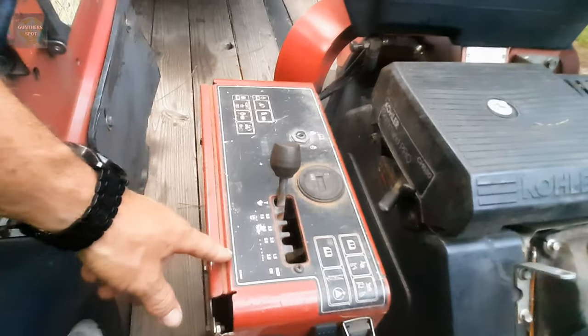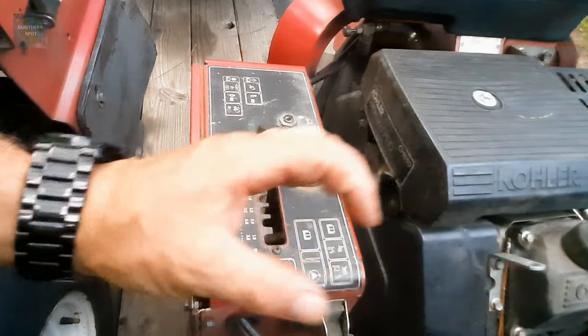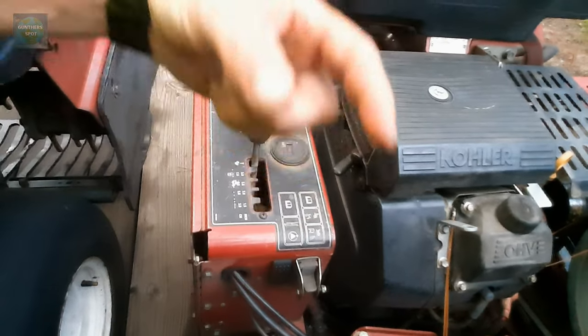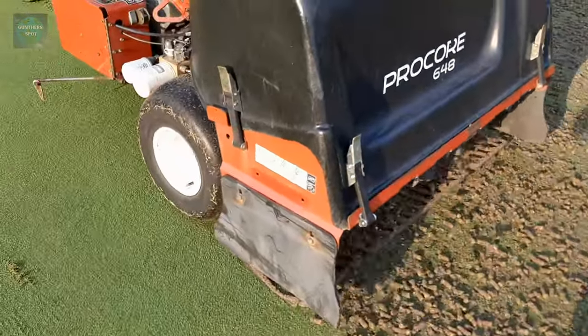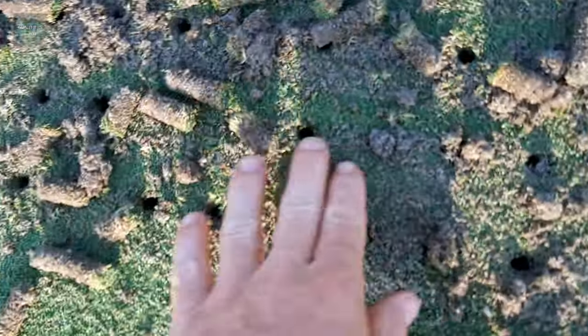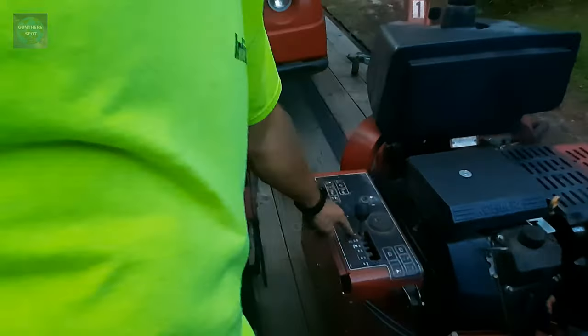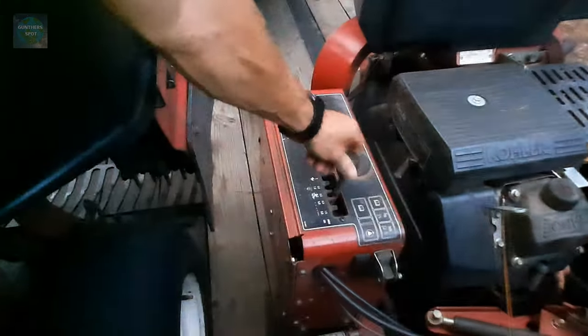This is your spacing on your tines. You have three inch or one and a half inch — that's in inches — which is how far apart your tines are going to be spaced. Do you want an inch and a half square or a three inch square? We are aerifying on an inch and a half spacing, meaning each square is about an inch and a half by an inch and a half. Always make sure when you're transporting and not aerifying, you always want it to be in T for transport, right here. Whenever you're moving it, always keep it in transport.